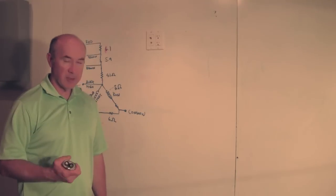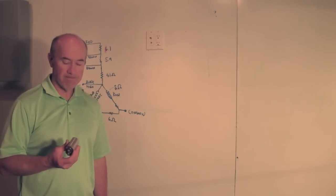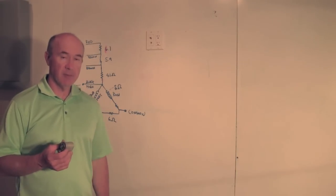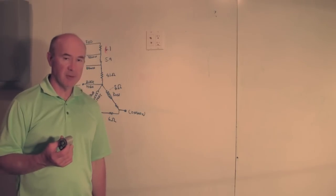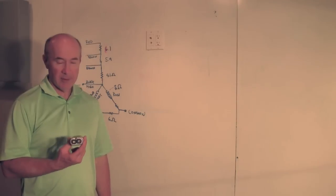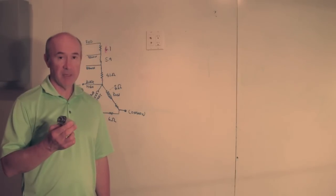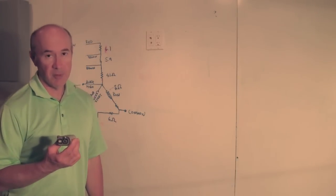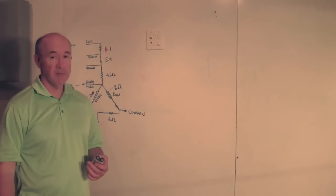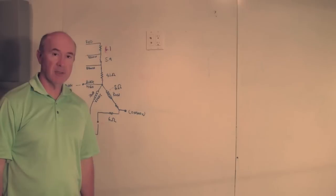So I went to start the fan and it still didn't move. So when these are bad, you can spin the motor by hand to get it started and it will run. So I did that. It might be a little bit dangerous to do, so if you try to do that, be very careful. But anyway, for the price of this part, if you're replacing the motor, it might be a good idea just to buy one of these, either just in case or just to replace it anyway. So I had a bad RUN capacitor too. I don't know if the failing motor caused it to fail or vice versa, but just something to consider.